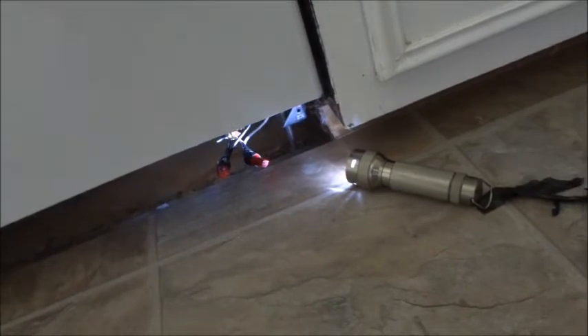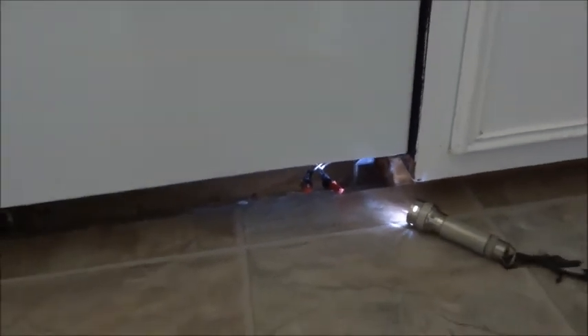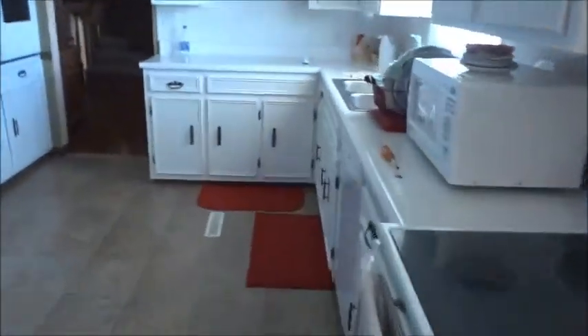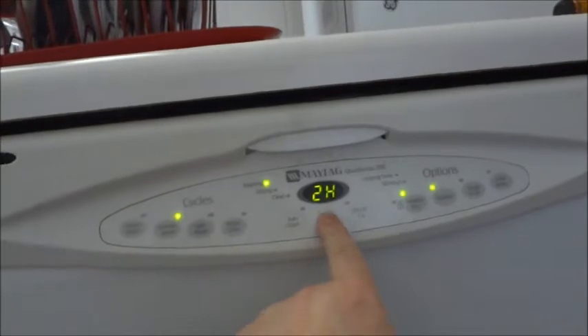Like I said, it was a horrible wiring job with no wire nuts, so I redid that and put wire nuts on with black tape. I shut the main off because I didn't know what breaker it was on — I wasn't about to take any chances. Now I'm turning the main back on, and it's got power now.